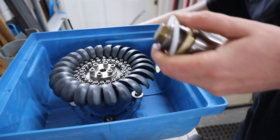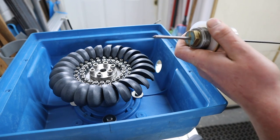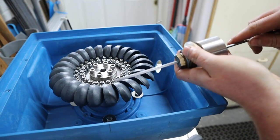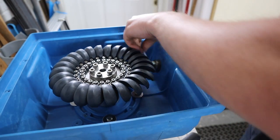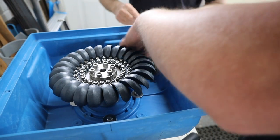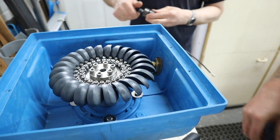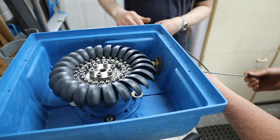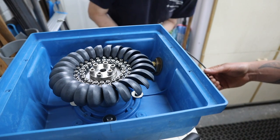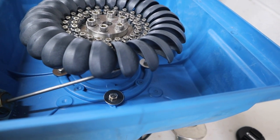Right, we're going to mount this gizmo — the old gizmo — and clamp it. We use this spike on the end to get a very accurate measurement and direct the jet where we want it. So I'll just be able to tighten the bolt through there and it'll tell us where we're going to be hitting. Currently that jet is missing the cups — it's sliding past them.